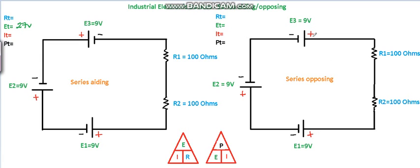On this one, I've got positive-negative, negative-positive, negative-positive. So we have positive-negative, positive-negative — that's 9 volts and 9 volts, which is 18 volts. But this one is opposing, so it's a negative 9 volts, which cancels one of them out, leaving us with 9 volts.